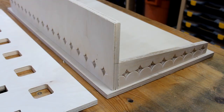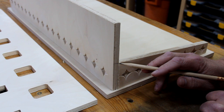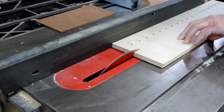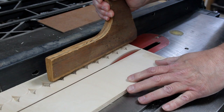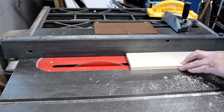The pedal board is starting to take shape, and I do need to cut this front piece to the right height. And I've made a mark here because the side piece is at a 7-degree angle, so I want to make sure I match that angle there. And then I'll use some of this leftover piece up here to cut a thin piece to go along this side to close that in. I flipped this off-cut piece around so that the angle matches up with the side piece. So now I just need to make a straight cut here.